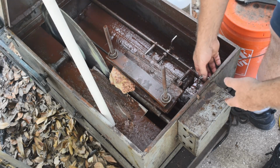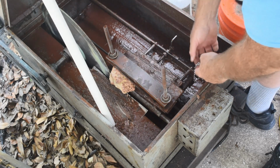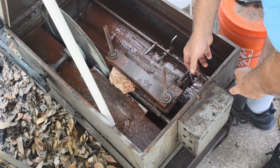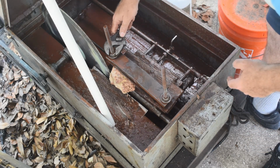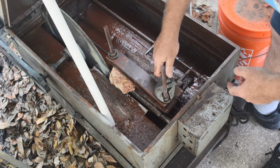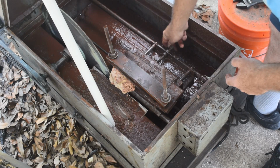But I also have a backup here. This chain, when the carriage gets over here so far, will go taut and it will pull the switch off. So I've got a backup there. I'm sure this saw originally came with that, but at one point in the past it got lost. So in one of my rebuilds of the saw, I put that back on.